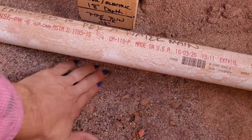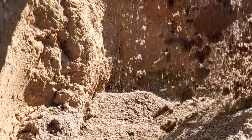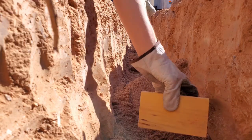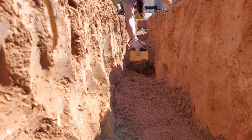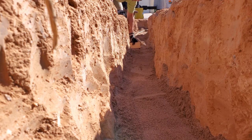According to the code, we had to excavate not less than three inches below the new pipe and backfill with code-approved bedding material. In our city, river sand is an approved bedding material, and that's what we have here. The inspector we spoke with at the city specified we needed at least two inches of sand around the entire pipe. We're combining the advice of the two-inch wrap with three inches of sand below to follow the code guideline due to the rocks.